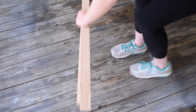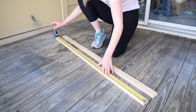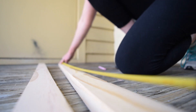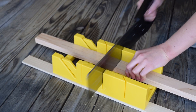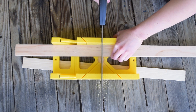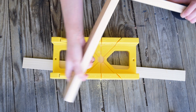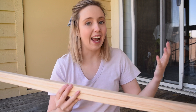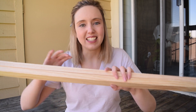You're going to need two four-foot one-by-twos and five three-quarter inch by two, two-foot-long boards. I wanted to cut my four-foot boards down to three feet, so I measured, marked, and cut them using my miter box and handsaw. But you could totally make this hanging garden however tall or short you want — it is completely customizable. Now that the vertical boards are cut to size, it is time to start adding on the horizontal boards for this amazing hanging garden.